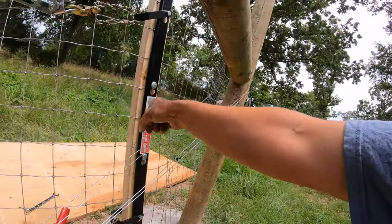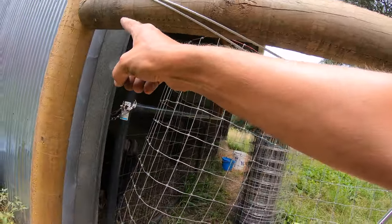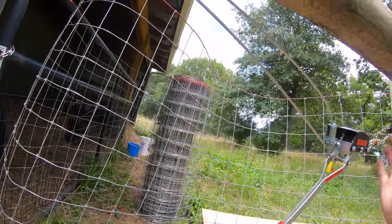Let's keep going. Just for myself, I want to make a note. This fence pole is about 6 feet away from the post. So as I do the other ones, I'll probably target right about there so I can have the maximum amount of ratcheting to tighten it up. You don't want to run out of cable and have it still not be tight enough.